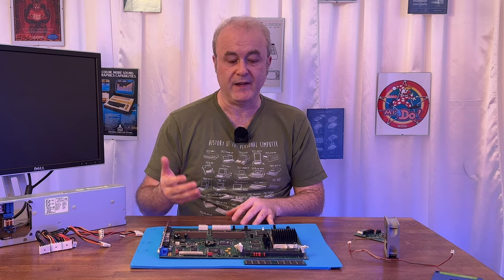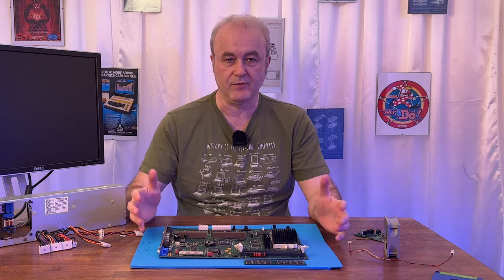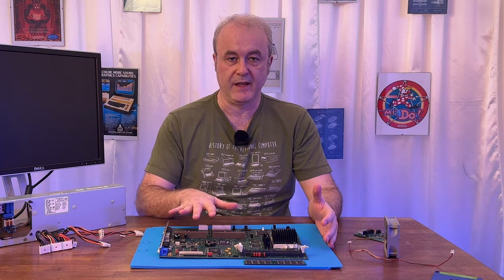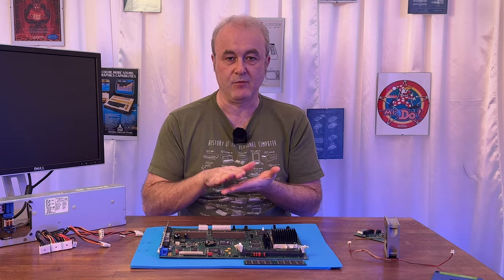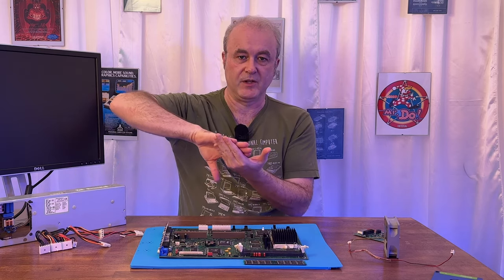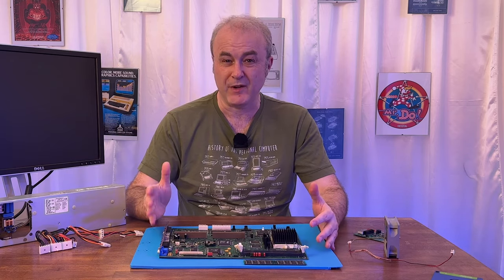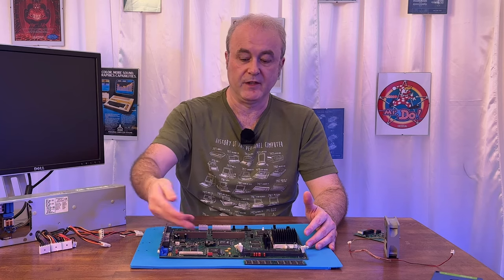And the reason for that is, if you have any slots like this, if you have any microchips which are quite flush to the actual logic board, then obviously water can get trapped under there. And because of capillary action, if the gap is small enough, it can get trapped under there really, really good. If you turn the machine sideways, it's not going to just flow out because it's actually got a sort of suction between the chip and the logic board surface. So with a compressed air gun, you can blow underneath the chip and you'll actually see streaks of water coming out until you see nothing.